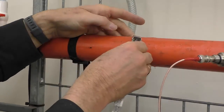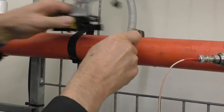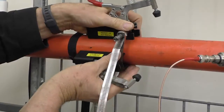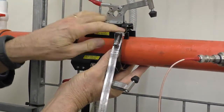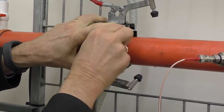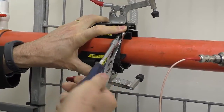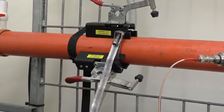I've put the Python clamp around the pipe here. I'll put one of the fixtures here for holding the transducers in place, then put the second one in place. It's always a bit tricky because the things are often quite hard to hold. I'm going to just pull this a little bit. When you lay this screw down flat, it largely locks in place, and it's just a matter of tightening it up — we can get a really good grip. They're solidly in place. You can use a cable tie on this if you wish.